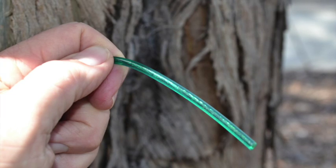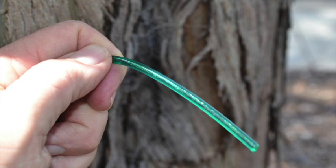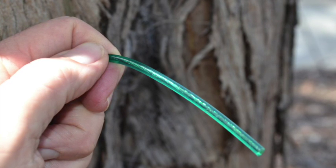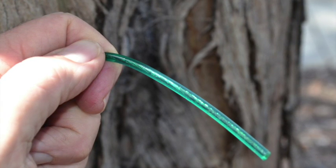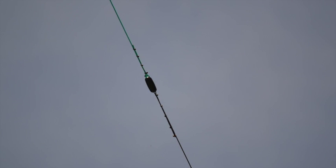The first point of note is the guy ropes — well, to be honest, I did away with ropes. Now I use a 100 kilogram load, plastic coated steel clothesline wire. When the plastic rubs through, there's the steel wire left, and it ain't coming down in the short term. Of course, to attach it to the antenna, I've used a plastic egg insulator, so the guy wire has no close contact with the wire from the antenna itself.